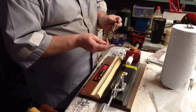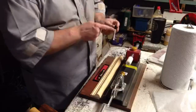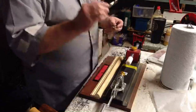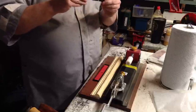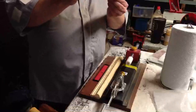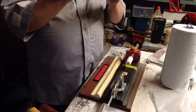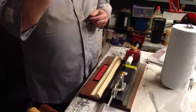Okay, so just to recap, I put the spring over the refill. Pushed it slowly through the mechanism over the refill, applying pressure, threading home, and then this portion that's got the end cap already on it, that's just a push friction fit over there, and let's just check now. So that's a very graceful Sierra, easy to turn. It's taken me a bit longer than normal because I've been trying to explain everything in good detail for beginners. So it's a Sierra pen with a 4,000 year old piece of bog oak.